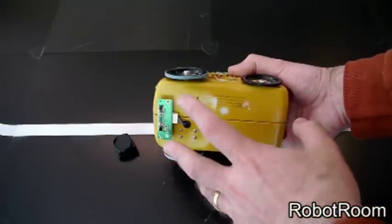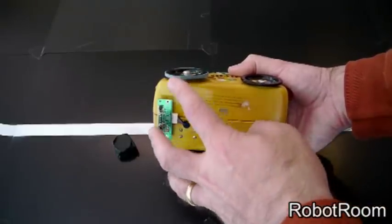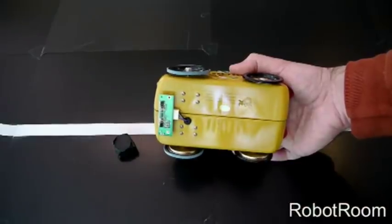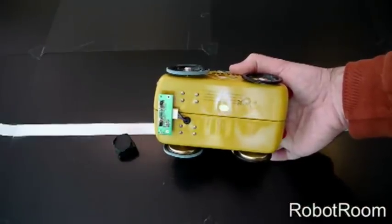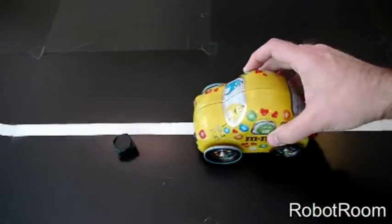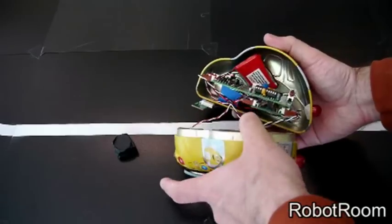That's common in robots with four wheels. If you have two powered wheels and a place to slide, you usually don't have that issue — but if there's way too much weight on the slide it'll also lose traction. Yummy had that problem: it would sometimes drive along and then get stuck because it would hit a bump. The tweak was really, really simple.